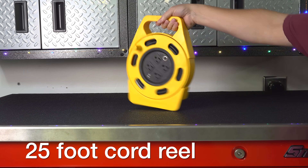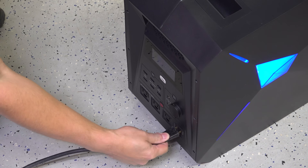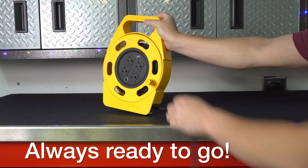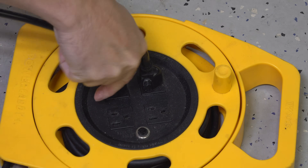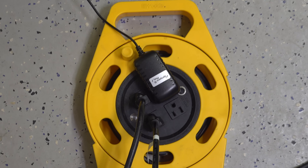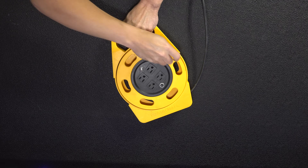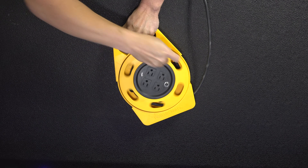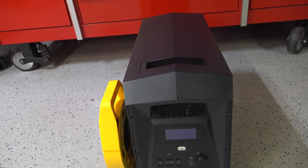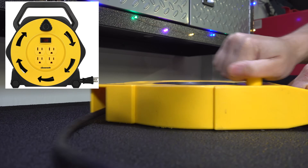These are 25-foot cord reels. They're inexpensive and the benefit is that you run one cord but you'll get four plugs on the other end. This works really well if you're going to place your generator in the center of your house — you can run one or two of these to other spots and get four outlets in each location. This model also includes a light so you'll know when the connection is good. These have a huge advantage over extension cords because when not in use they reel up quickly and store in a small amount of space. This one's older and no longer available, but I've linked a newer updated model in the description.